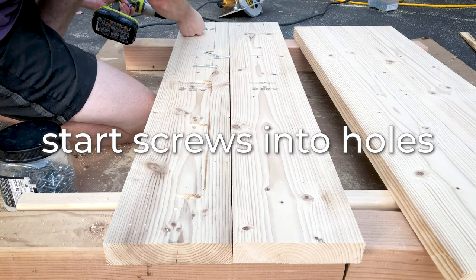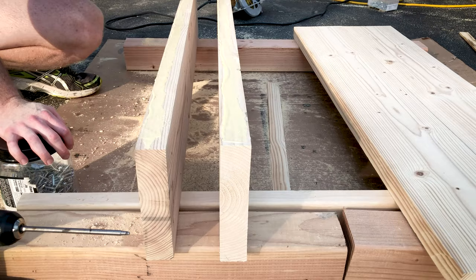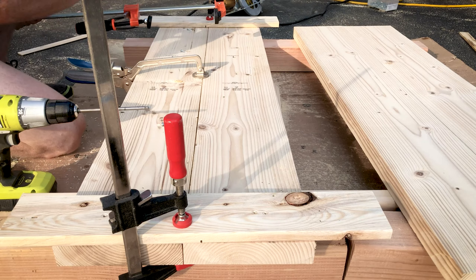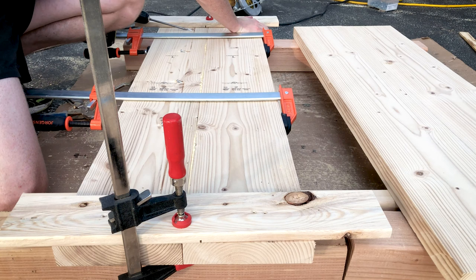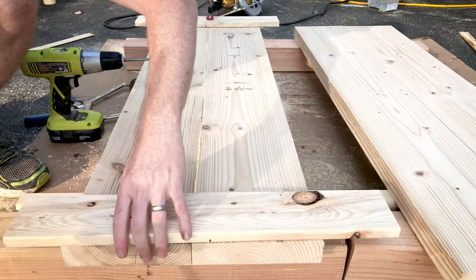When the pocket holes are drilled, I like to start my screws into those holes. Then I flip the boards on their sides to apply the glue that will strengthen the joint. Now I'm finally ready to put these together, and it's good to clamp the heck out of these boards — this part is super important because it will ensure everything is nice and straight. Once I have enough clamps, I'm ready to screw it all together. Once it's screwed together, you want to immediately wipe away excess glue with a damp rag, otherwise you'll be very upset with yourself. It's good to let the glue set for at least 30 minutes before taking the clamps off. Since I'm putting together four boards, I'm essentially going to repeat this process two more times, then I have a nice coffee tabletop.